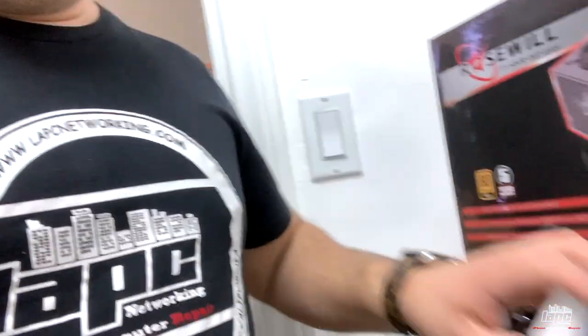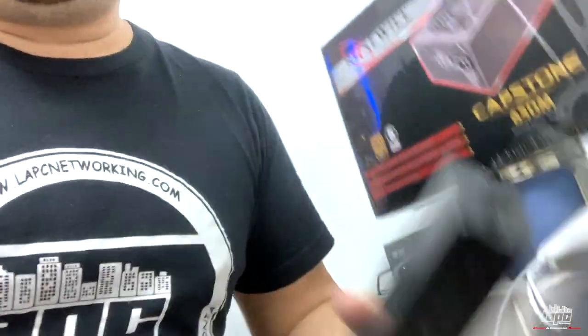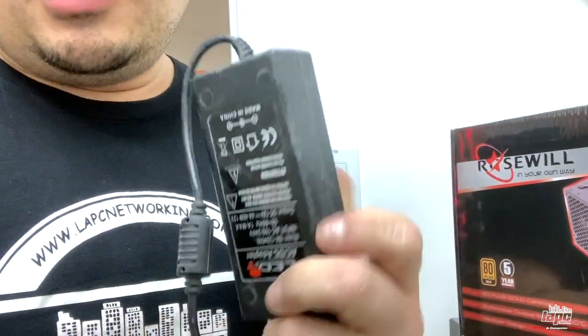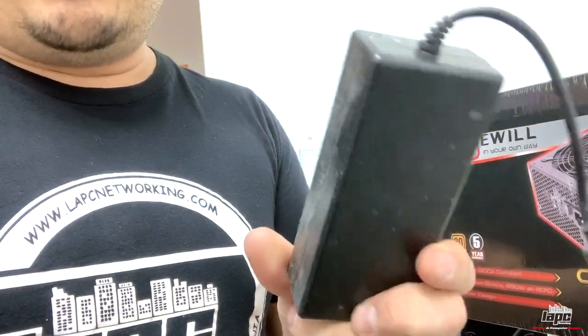In the beginning, I thought the LEDs were going out, and I tested the receiver, but the receiver is fine. I find out the problem is this power supply. I don't know if the brand is not really good, but I already have five pieces that are bad. I don't like to be working and trying to repair something that's going to break in two or three weeks.